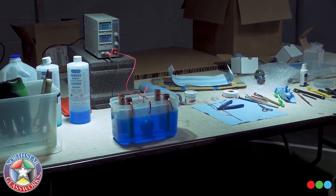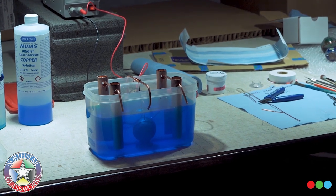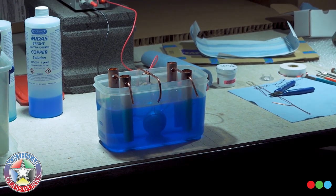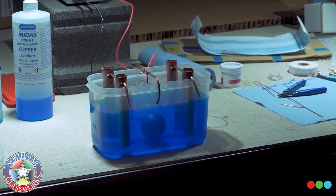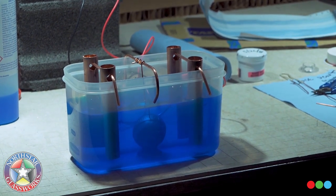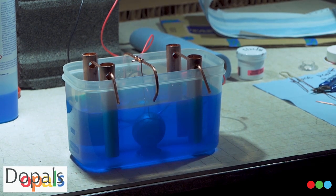to a little tiny piece of copper, because the only part that it's being drawn to is the tip of that copper wire that's sticking down there. And it will start fritzing out all this stuff and it will really hose stuff up. But that's what I've learned to do, is just look at what this is doing. Now that it's bouncing between, I know I can turn these amps up a little bit more now.